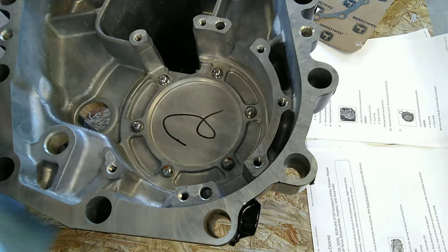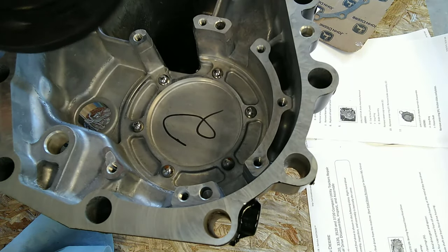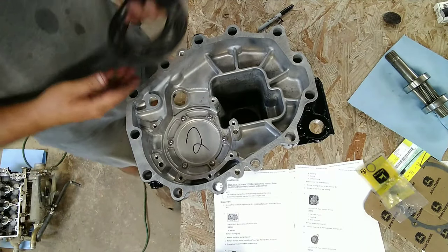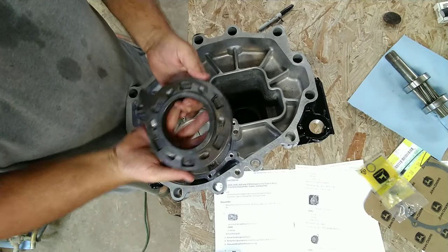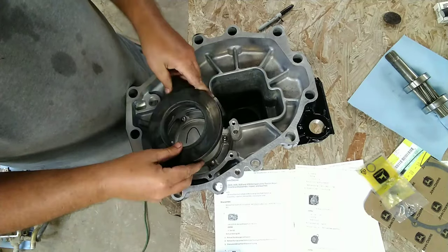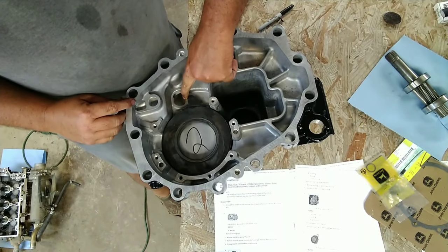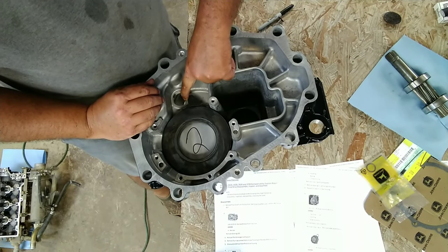And then this plate here, this actually goes down on the ball bearings. You want to make sure that's clean of any debris also. Get you guys at a little better angle. So your ball bearings ride in these dimples, and this will only go in one way. Like this, this is where your brake surface is. Set this in there, and that'll fall into place. And when you turn this, the plate will actually raise up, and that's what tightens your brake.